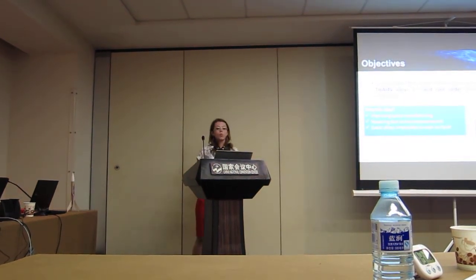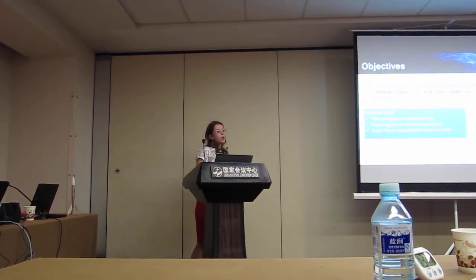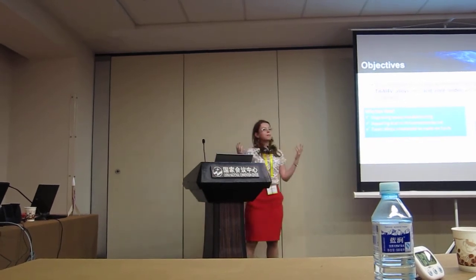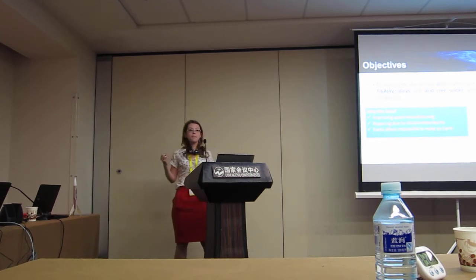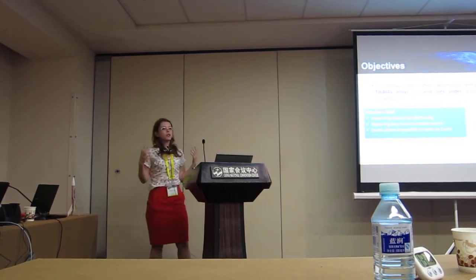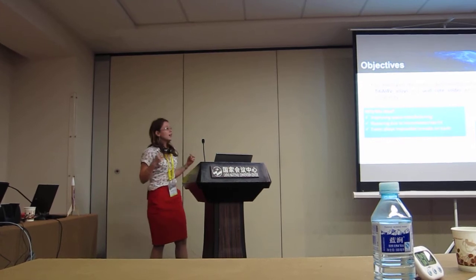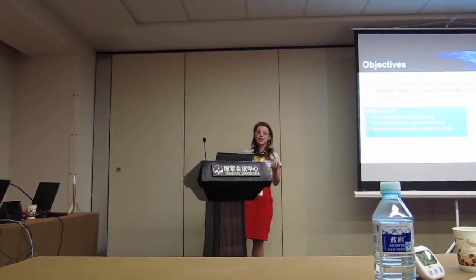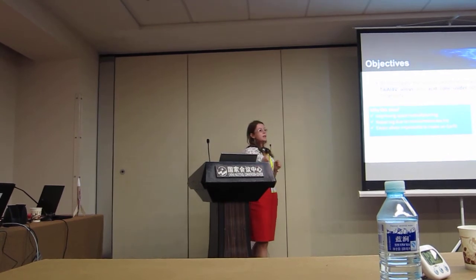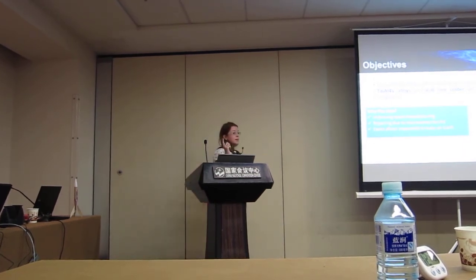Our objectives are to investigate the surface deformation and properties of titanium alloy and acid core solder when we melt and weld it in milligravity. We want to improve space manufacturing, which has potential benefits over Earth-based industry. For example, items too large to launch in one rocket can be assembled in space. Also, micrometeorites damage spacecraft and in-situ repair is sometimes necessary, such as on the International Space Station. Additionally, alloy formation is affected by gravity — on Earth the crystal structure forms imperfectly, but in space we get a finer structure.